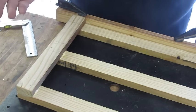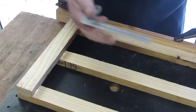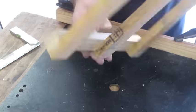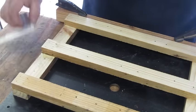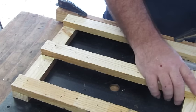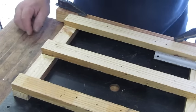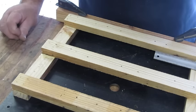And so now it's just a matter of wash, rinse, repeat. Only since this side is assembled, we're going to use the combination or the carpenter square all the way around again, doing just the same thing we did before, lining it up, gluing it in place, and then shooting it together. And I'll repeat for the other side. So when it's ready for the 19-inch stretchers to go in, I'll be back.